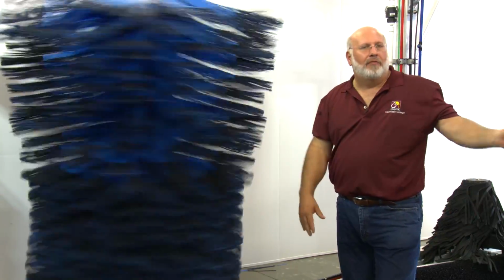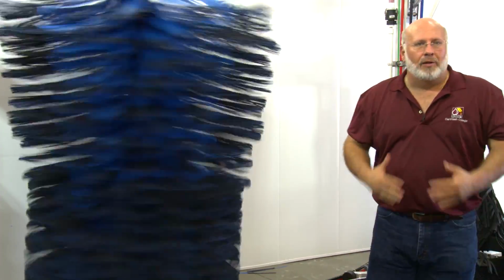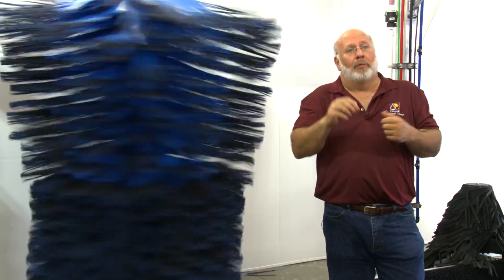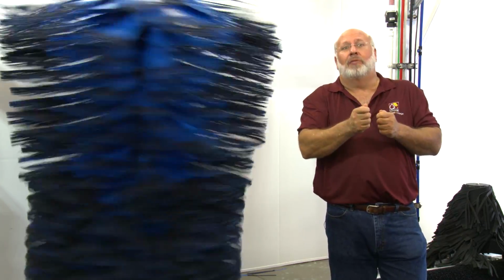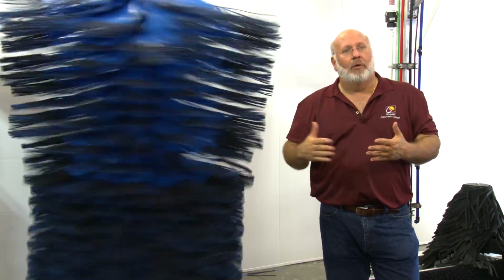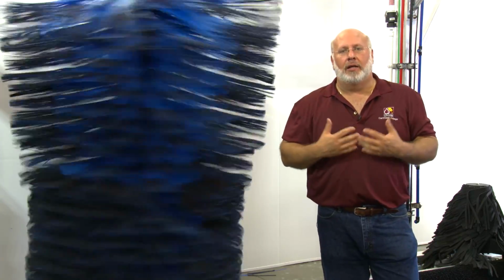So we'll go back and set our front set also at 55 hertz, and that's how we're going to start this car wash off. So if we need a little more cleaning power, we know we've got 5 more hertz to go. And if we have to even go past that, if this becomes a great success, we can program that VFD to take us even to 70 hertz or 80 hertz, and we can push this a little bit faster. So we've got a little bit of flexibility there, and it'll really help make this car wash be able to be dialed in at its maturity to make sure the customers constantly get a clean, dry, shiny car.